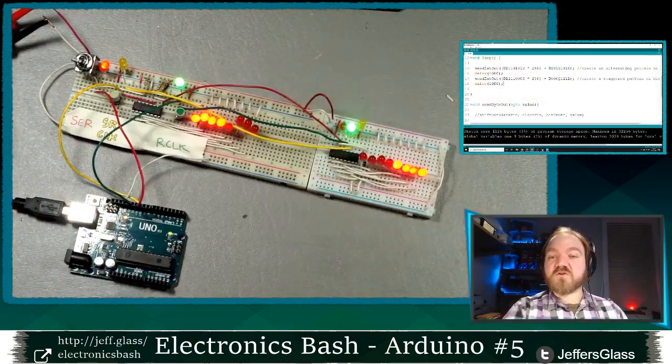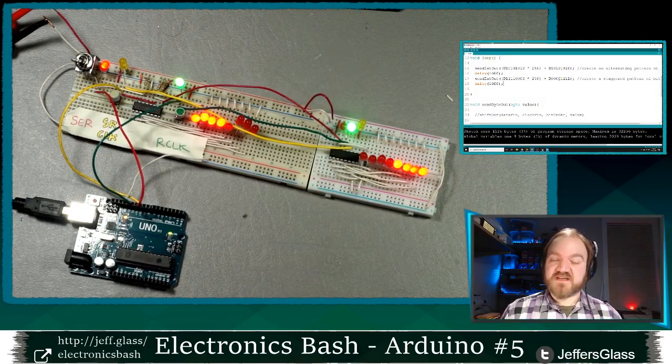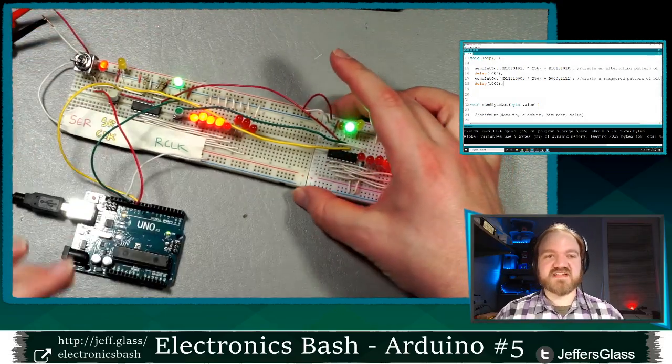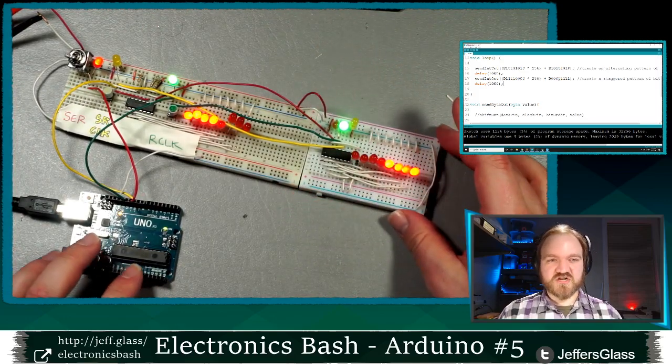Kenneth clarifies, yeah, the Arduino binary header only says 1 to 8 bits. So you could do shorter numbers, but you can't do any more than 8 bits with that B and then ones and zeros construction there.